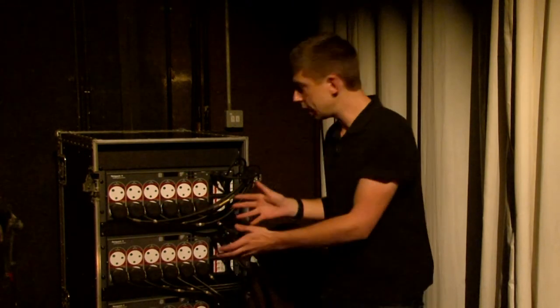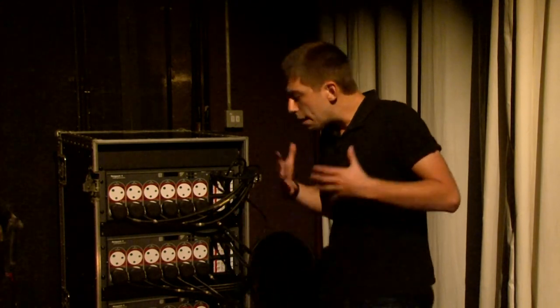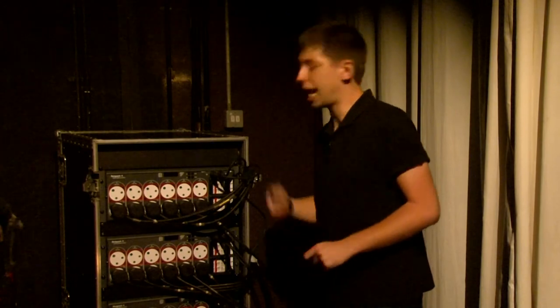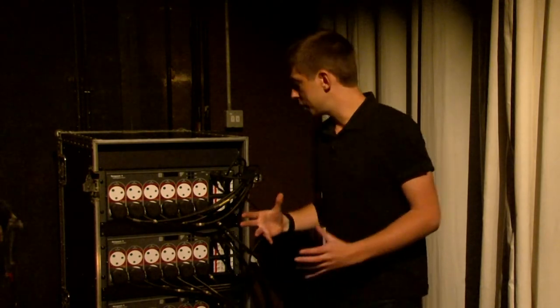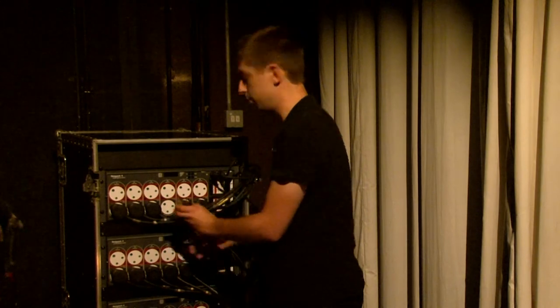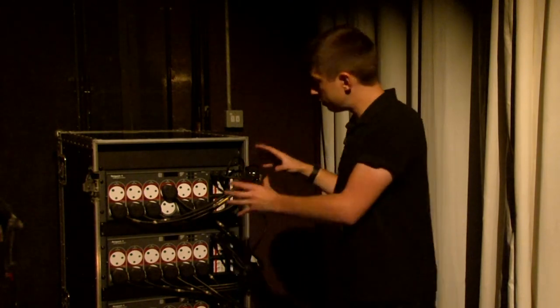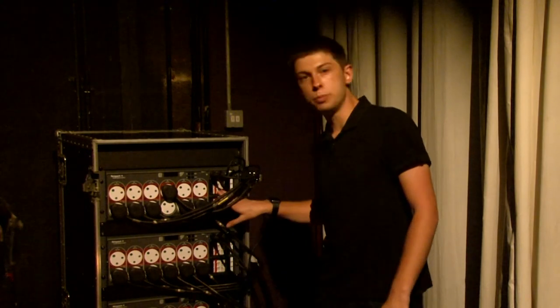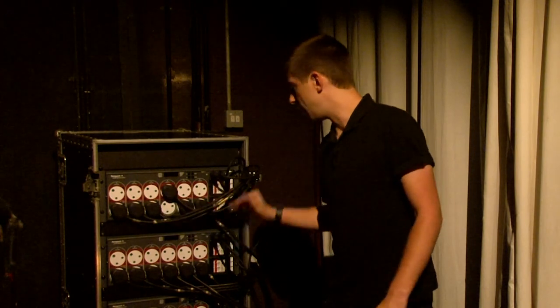All of my 15 amp plugs are in my bottom row of sockets — that's my dimming sockets. But if for a particular show I realise I've got a moving head fixture in circuit 4 on my first dimmer, before powering up my system I can literally come in and just pull out that one from my dimmed socket and instead plug it into my top row of hard power. BetaPak 4's top row is non-dimmed, hard powered — they go back to the same MCB as the dimmed channel and just pair up.